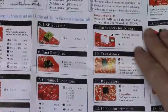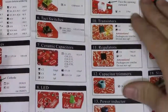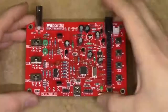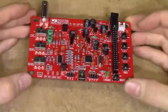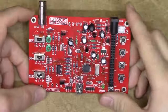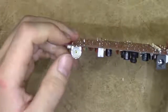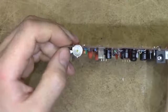I had no problems following the instructions even in my somewhat impaired state. In the end, I did end up with a fully assembled board. My kit included all the components and I haven't noticed anything missing. There are a couple of tricky things about this board, though. The first was that I managed to absolutely melt the BNC connector — the plastic in it is not solder-resistant at all, and it takes quite a bit of heat to get those thick tabs soldered properly.